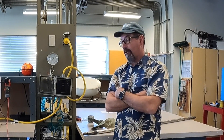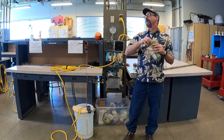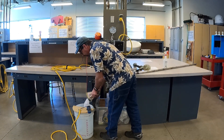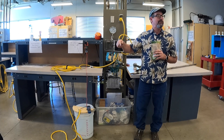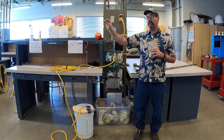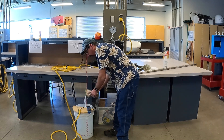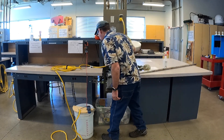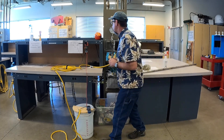Now I'm adding a little salt. This is ball canning salt. After adding salt, we're up to an amp. A lot of that salt probably isn't in solution yet, but salt water like we have at Capsani Marina is almost optimum for raising the conductivity of the water. Adding a bit more salt — it was at zero before — and now we've got four amps. Voltage has actually gone down to about 35, fluctuating on AC, now down to 18.